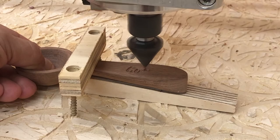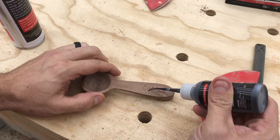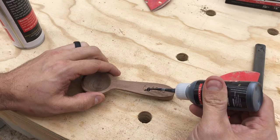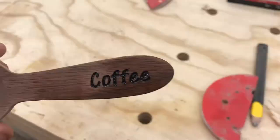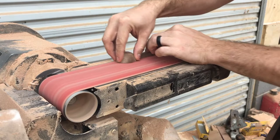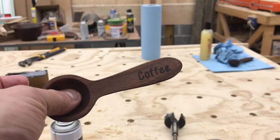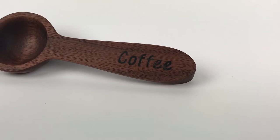The reason I have these flat is because I want to CNC them — the idea is to make coffee spoons or scoops, and I really wanted to put that on there for that added touch. After the CNC, I use black Starbond CA glue, which is some of my favorite stuff. I lightly put it in those grooves, spray the activator so it hardens up, let it sit for a couple of minutes, take it to the belt sander and lightly sand it, then hand sand with 320 for the final look.